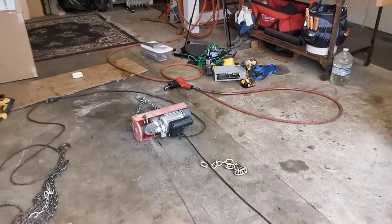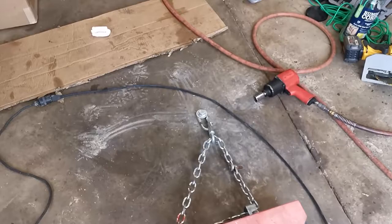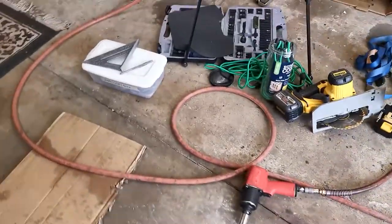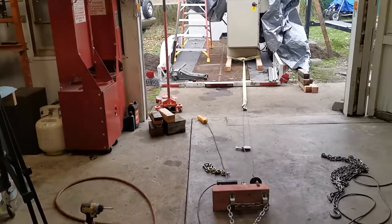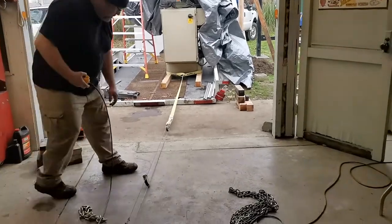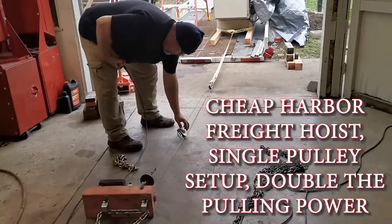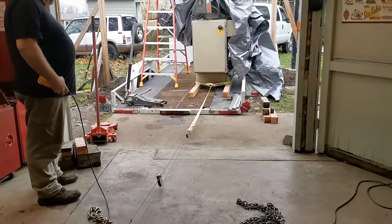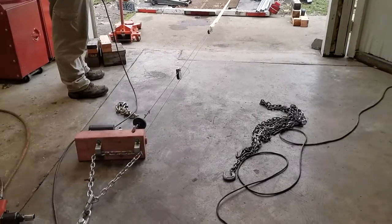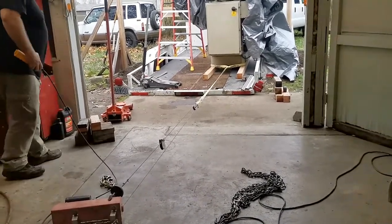Now I've got a new setup. I had to get the come-along off my gantry and I drilled a hole and put a five-eighths bolt in the concrete. It's a triple-pull setup so it has three times the pulling power — it actually bent the bracket. I ended up having to put a pipe underneath it like I was doing originally because it just won't roll without it. Staying clear of the death zone here.